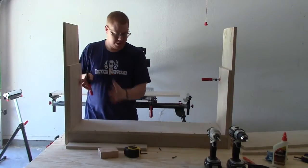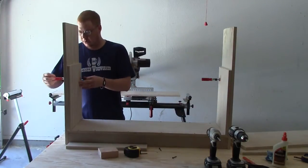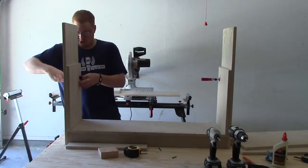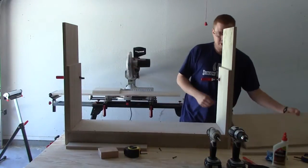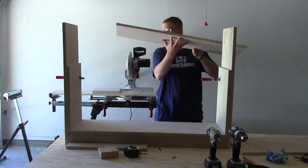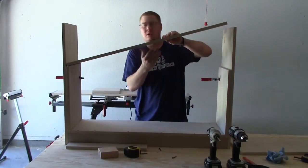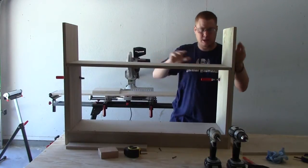These dividers will end up offset from the ends, but I'm going to clamp them on the ends down here just to give me a spot to place the shelf that goes across. I'll put some glue on the ends, set one side down, kind of push that in on this side, then let it come together.